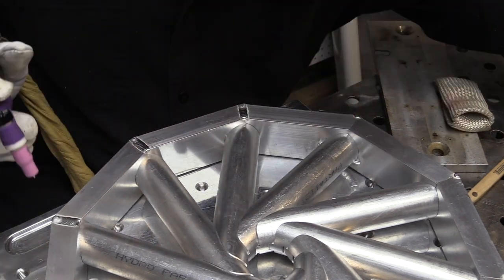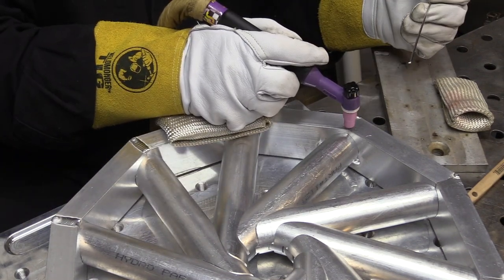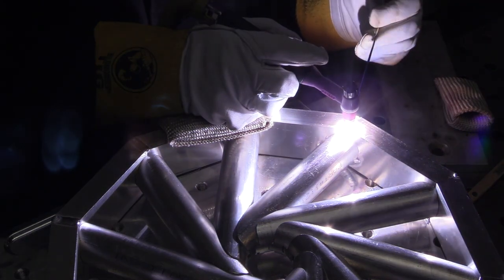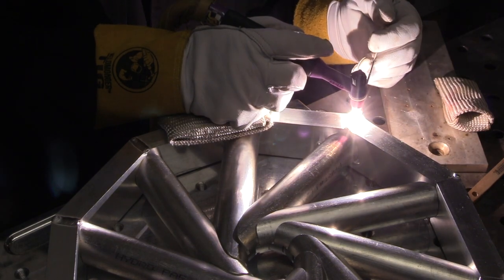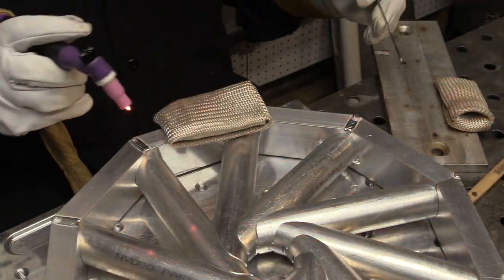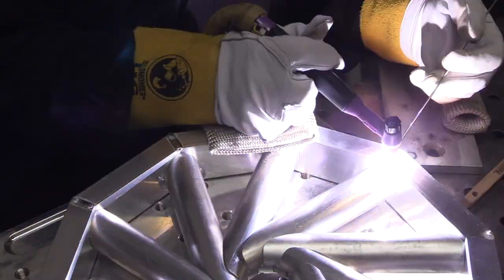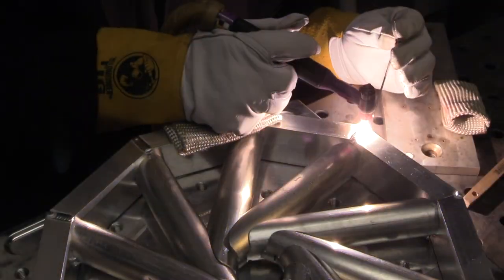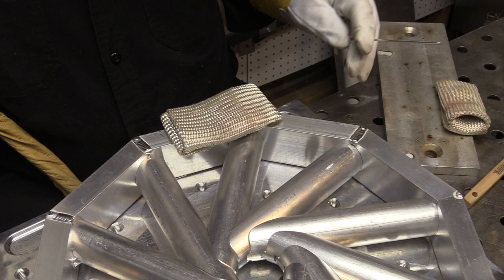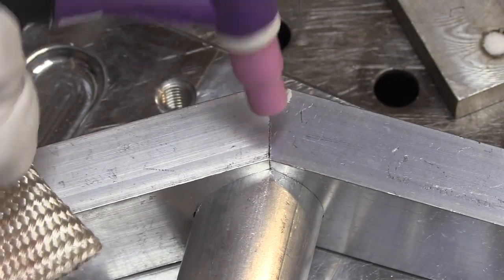There are so many welds on here and this piece is getting pretty warm, so I'm using my TIG Finger XL to prop on. Sometimes I'll put it on, sometimes I'll just use it as a little prop — just depends on the job. Aluminum parts get hot really quickly, so it's nice to be able to prop anywhere without having to grab a wooden block. There's something I haven't talked about yet: filling in the crater at the end of the weld.